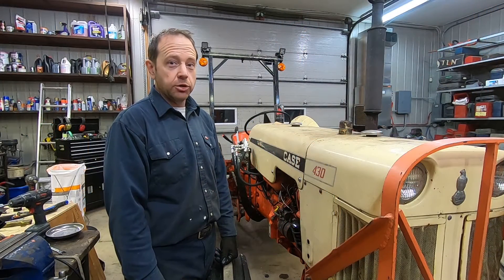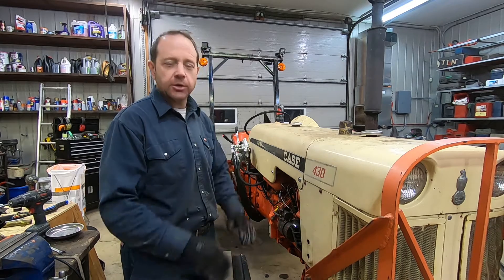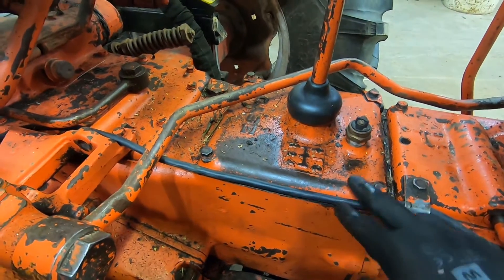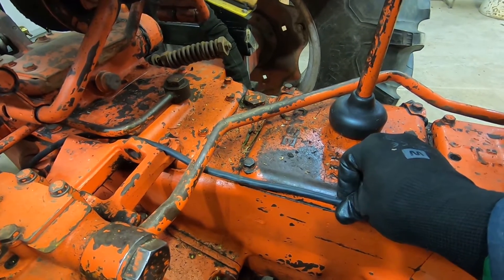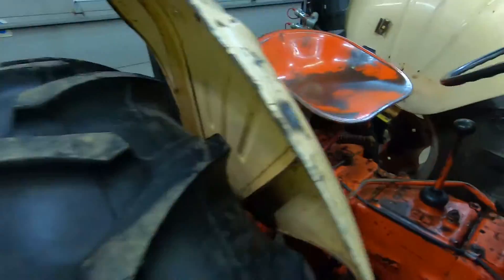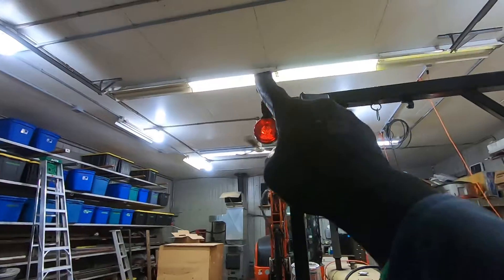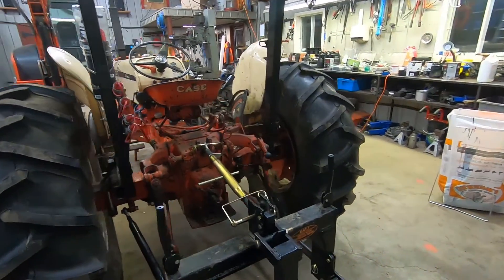Electric wiring work is the kind of stuff you want to be very concentrated on. I kind of finished the project, but I'm going to show you what I did. I used a small cable — the kind for outdoor extension cord — so it's still flexible with very good thick insulation, strong to wear. I like to use it around 12 volt. Now it goes through the bottom tube of the ROPS, it goes up there. I put flashers and lights and a working light here so I can see right behind the tractor. This is what I was missing on the side-by-side.